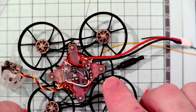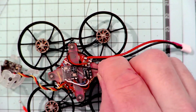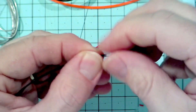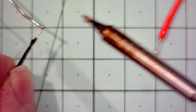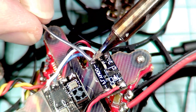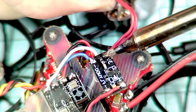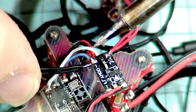To do that we're going to need two trace wires for the positive and two trace wires for the negative coming off the voltage regulator, running out to the LED strips on each end. From the positive and negative terminals we run two sets of trace wires — we just twist them together, tin them, and trim off the excess. The positive wires go out the front and connect to one end of the COB LEDs, and the negative wires go out the opposite direction and connect at the other end.